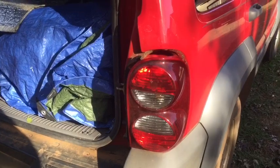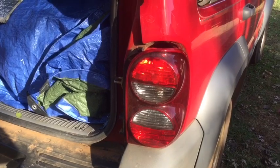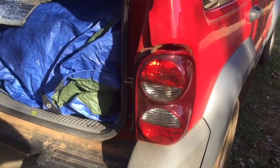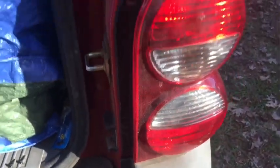Okay so we've got an assistant in the vehicle — go ahead and press the brake pedal. Hey look, our brake light works! Go ahead and let up. We've tested it, now we can reinstall it. Remember we're just gonna slide these pins back into their sockets on this side, just press that light forward. You'll hear it kind of snap in, and all you've got to do is reinstall your two screws and you're done.